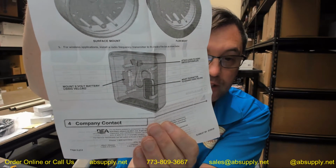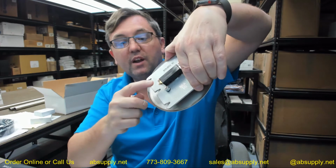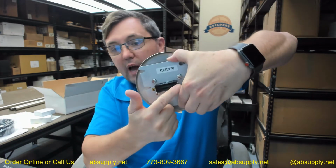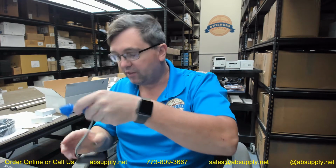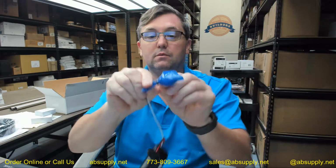Okay, so the transmitter is going to fit inside of the box and then connect to the cherry switch. So from the cherry switch, if you recall, we've got common and normally open. Your flag connectors, you're not going to need to source because your transmitter is going to come with them. They're inside of this packaging here. Common, green, right? Normally open.